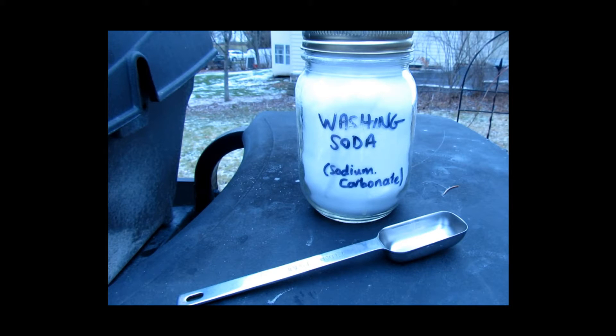In the water you're going to have soda ash, which is also called washing soda. I'll show you how to make your own at home in this video. You can also buy it — Arm and Hammer sells a washing soda product at the grocery store or online. Pool stores also market it under soda ash. The steel and the rusty trap are going to be in an electrolyte solution of water and soda ash, and basically electricity passes through and the rust will come off the trap and go onto the sacrificial piece of steel.